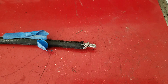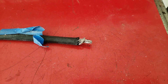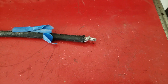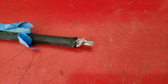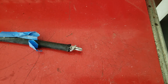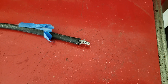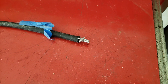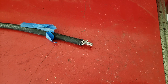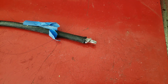Let's look at the wire that was plugged in to the air conditioning breaker. Whoever did this previously must have been nuts, but here's why it was like this: the opening for the wire is too small when using aluminum wire. Therefore they had to kind of cut it and splice it in, and on top of that they didn't even use any anti-oxidation compound. Anyways, this is what it is — let's continue.